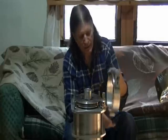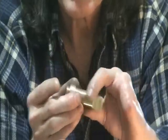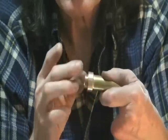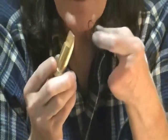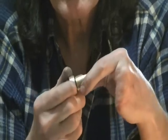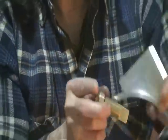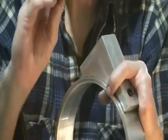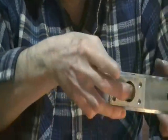Now to assemble — here's the slotted brass and bronze piece. I made this out of two pieces: a brass body and a bronze ring threaded onto the brass body. Again, you put a 1/16 inch or very thin O-ring up front, like so. That drops down into the slot. Your nozzle outlets have to be pointed down so the gas goes into the rotor section.